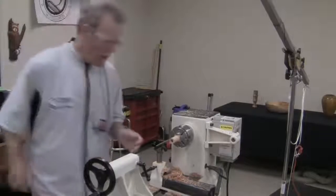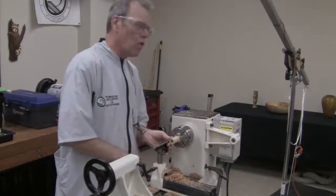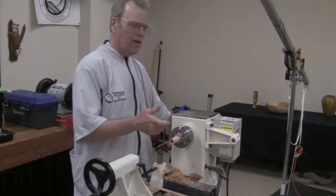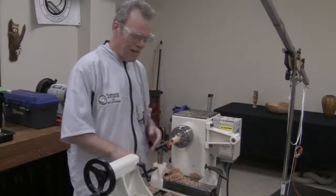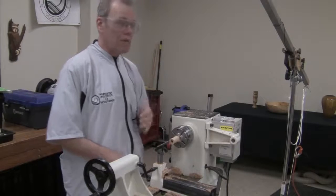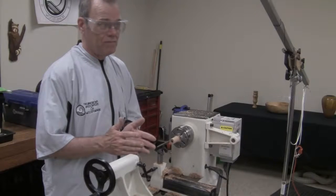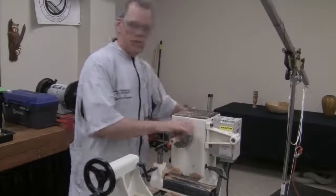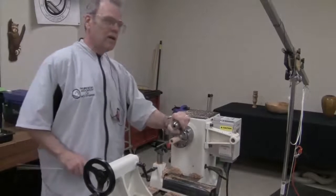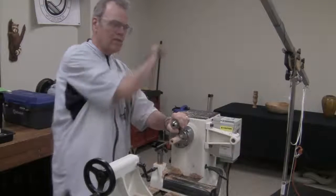I had some concerns when I bought one of these, I got it from Steve, one of these big one-inch drill bits that are really nice for boring. One of my carpool buddies said it doesn't have a flat area where you can grab it with a pair of pliers or something like that. So I contacted Rudy Lopez, who suggested it, and he said he's never had a problem with them. You just lock them in. Those Morse tapers are very strong if you use them properly and you keep everything clean. That said, I always use a drawbar when I'm using it on this end, unless I'm not putting a lot of pressure on it. I don't allow it to work loose and vibrate out. I always have a drawbar.